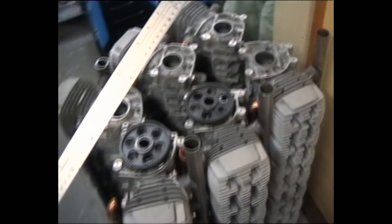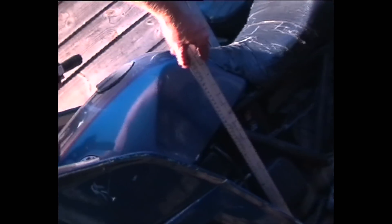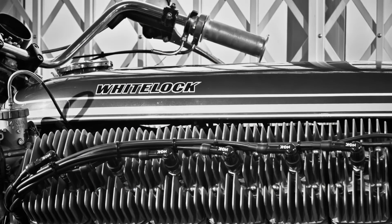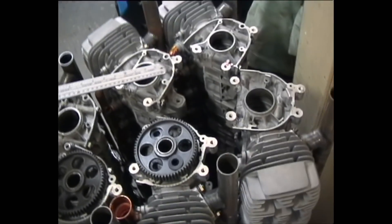That is the basic size of the engine now determined at approximately 750mm high — not too bad, given that your standard BMW is similar. That's going to go in somewhere like that, lower than the fuel tank. The width — ignore those gears, they're H1 input gears, worth a try — is approximately just under 600mm wide. That will be the top of the engine, and I'll probably make some sort of fuel tank to go in like that — 100mm diameter tank there.